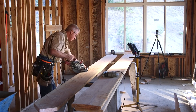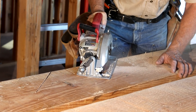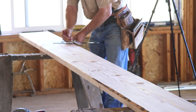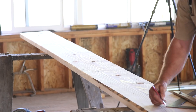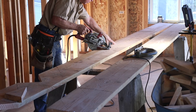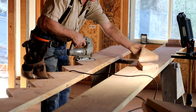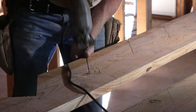There are a lot of ways to mess up when making stairs, and perhaps one of the easiest happens when measuring out and marking your stringer, which acts as a pattern. A small change in tread length is not a big deal if you have extra distance to play with where the stairs land. But a small discrepancy in the rise of each step, multiplied over a long flight of stairs, can add up to a mistake that's simply not acceptable — you could end up with uneven rises outside of code compliance or treads that aren't level.